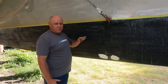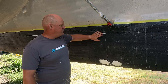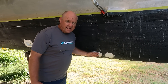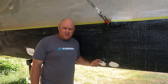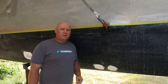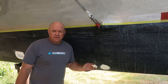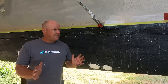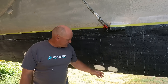What we've done so far is we've wet sanded all the hulls, being very careful of all the welds so we didn't take all the antifoul off them. Where the old anodes were and any bare metal was exposed, we roughed it all up with 40 grit sandpaper, then acid washed it and put some primer on. The first coat was very very thin and the second coat was a lot thicker - we thinned out the first one just for it to bond and then did a chemical bond for the second coat on top.